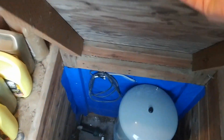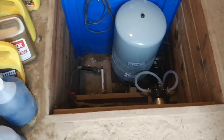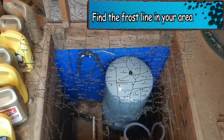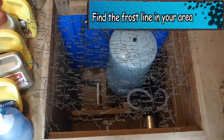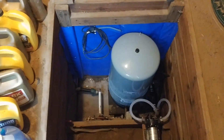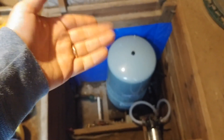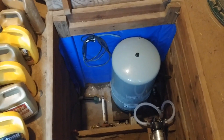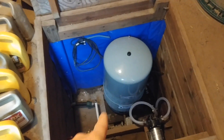The reason it's buried in the ground is because in northern Idaho the frost line can go up to two feet in the winter — meaning the ground can freeze two feet deep. Anything in the ground such as water would freeze. As you can see, the pressure tank is there — that's the top of it, just right at that line. But the bladder is blocking the water from going up that high; the water is actually much lower.